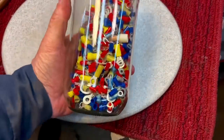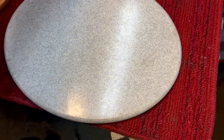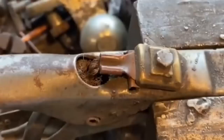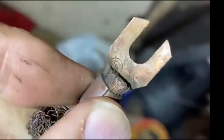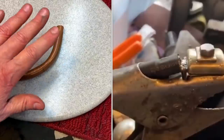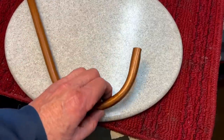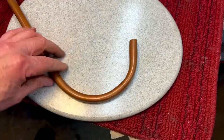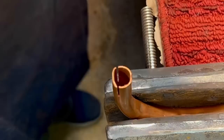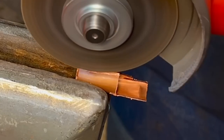Next up, remember last week we did the solderless connectors — we made them into solder connectors. My buddy Reggie on the road did a fantastic repair on a large connector that was on his welder. I wonder if any of you realize that if you don't have something, you can make it — farmers are great for this. Farmers always wind up making their own things instead of running to the hardware store because it's like an hour away. Let me show you something out of a piece of copper — this is why I always pick up copper scraps. I never throw any copper away. Let me show you what you could make if you're in a pinch and need to make a connector. Since copper is such a soft metal, there are so many ways you could cut it, and the thin cutoff wheels just zip through copper like you're going through butter. It's absolutely a joy to do.